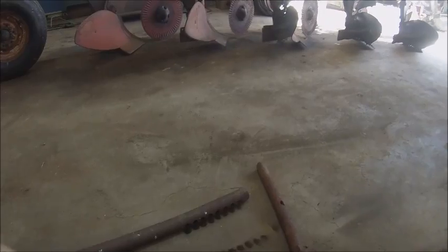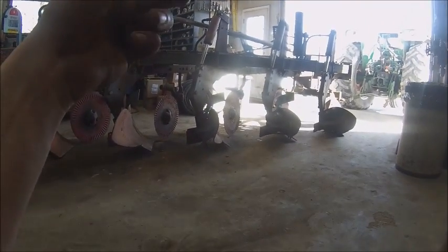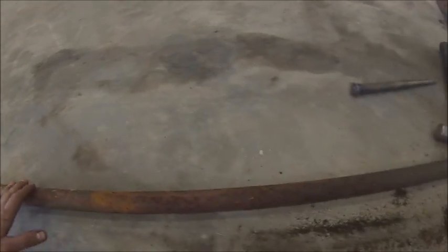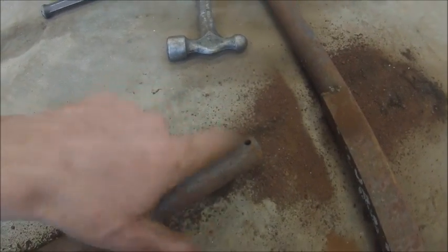So, this was interesting. This is the draw rod for your lift that goes between the tail wheel and the cylinder up there. And I thought it was odd that, A, I couldn't get the cylinder to hook up because there should have been a lot more slack in it than what there was. And B, I thought that damn thing was kind of heavy when I pulled it apart. Well, that's because apparently at some point they broke this front half and made it out of a shaft from something, because there's a Woodruff key and either a roll pin hole, or a hole in the end of it, and then this end they beat flat and then flattened it out with a torch and blew a hole in it with a torch.